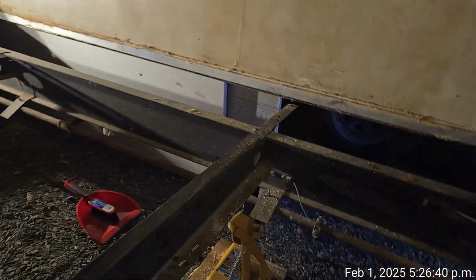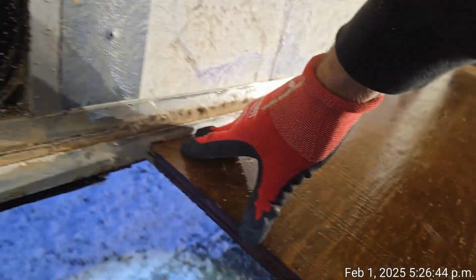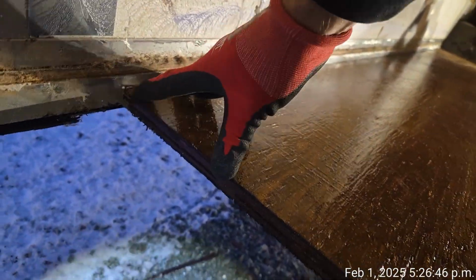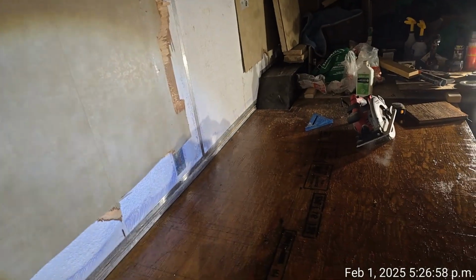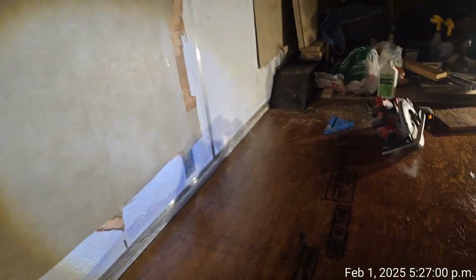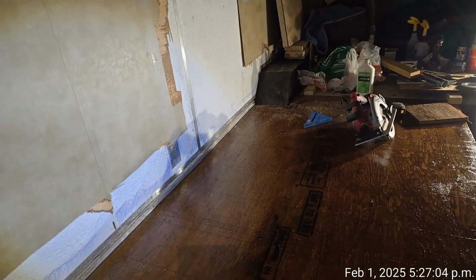Because it's not going underneath the aluminum, I was initially thinking about taking a router and routering it down and sliding a little sliver underneath, but it's not worth it. So what I'm going to do is get some aluminum angle, run it the length, screw it into the floor and the side, and that'll secure it nice and tight. Tight and right.